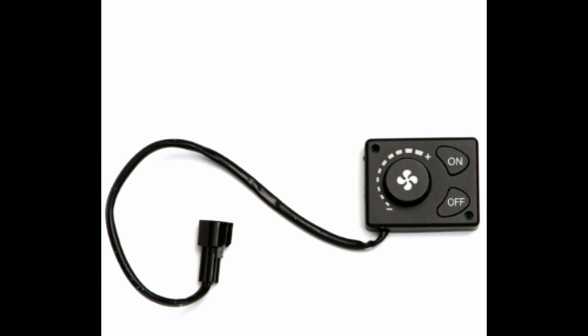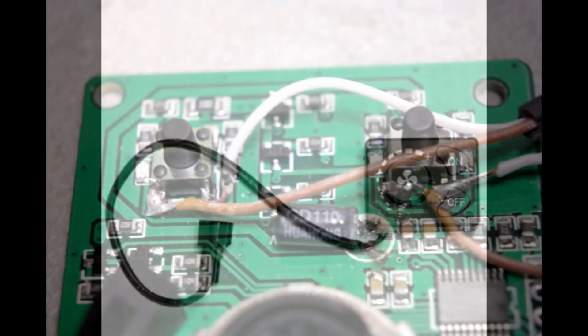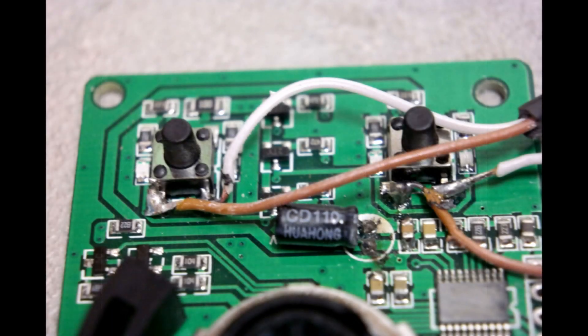Let's look at what Henk did with the rotary controller. The first one Henk had was the traditional black rotary one. Henk's use case required him to be able to turn off as well as on, so he needed a dual channel. There's no remote on these, so you're hacking directly into the back of the controller itself. You take the back off and this is what it looks like. The on button's the one on the left, the off button is on the right. You can see the location of the terminals you've got to solder onto - more space on this one, a bit easier to get to.